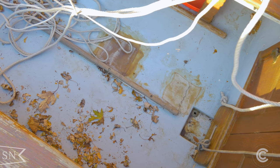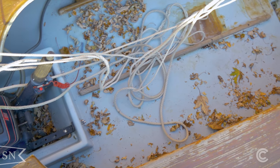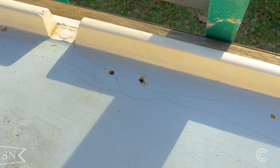Most things I need to do, a few things I want to do — it's going to depend on time and weather. Probably the biggest thing I need to repair on this boat is the cockpit sole. It's pretty well completely shot. It seems to be pretty sturdy around the edges but the middle is extremely soft. You can see several patches that were applied, and there's about a foot-long crack that if I put all my weight on it I'd probably crash right through it. It's going to require extensive fiberglass work, some woodwork to build reinforcing underneath it, and I'm also going to build a wooden grate over the top to add aesthetic improvement as well as a little better grip for the floor.